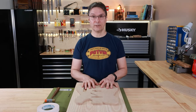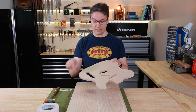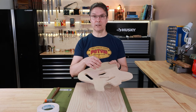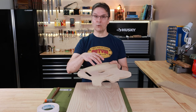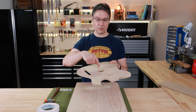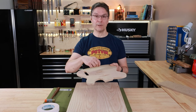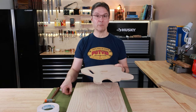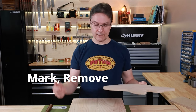The reason we don't drill through the templates is that the holes are exactly 1/8 of an inch and the drill bit fits perfectly — but if you drill through the templates repeatedly, after two or three uses the holes will start to enlarge and you'll no longer be able to find the exact center even with a brad point drill bit. So mark with the template, remove the template, and then drill.